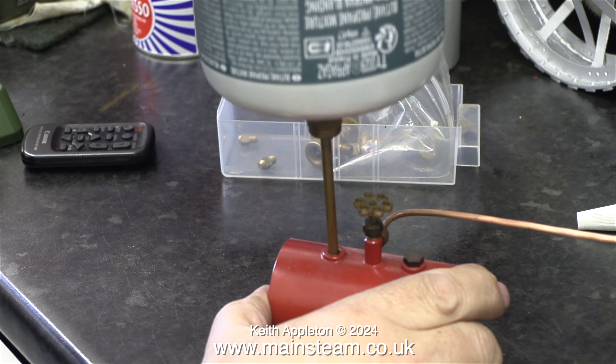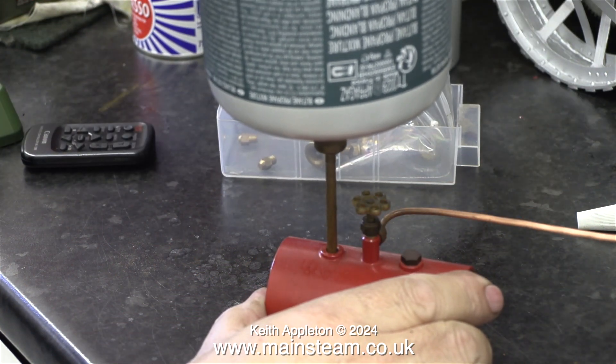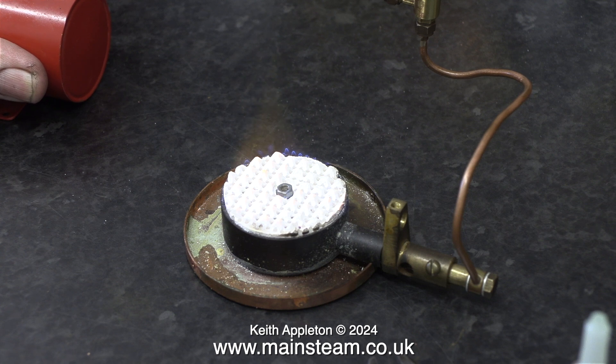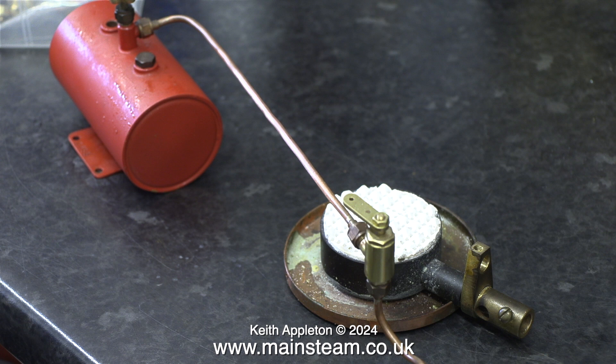Also, never fill them indoors like I'm doing here — never, ever do that. By the way, this is a faulty filler adapter; I've just bought a couple of new ones from Clevedon Steam. When you first light these burners with a number 8 gas jet, they don't look particularly hot, but as the thing warms up and starts to glow red, the heat increases. The big problem is that as the gas evaporates inside the tank — whether it be a canister or a small tank — the gas chills and the pressure drops. That is why there is a relationship between the size of gas tank and the size of gas jet.